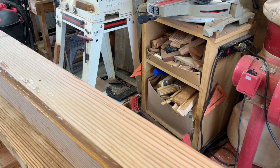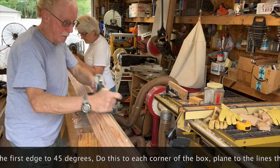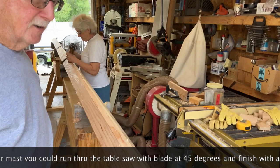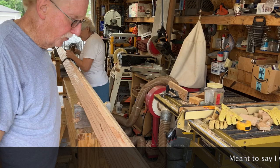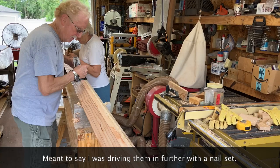I've got a confession to make — we used stainless steel nails to put the little triangular pieces on the inside. I've decided that didn't work out very well because they tended to wander, and I've caught one or two with the plane. Don't do that — use stitching glue like they suggested. That was bad judgment on my part.